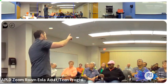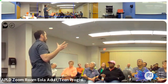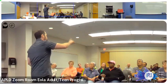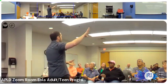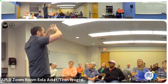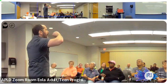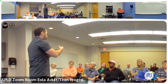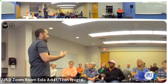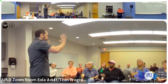One, they make washable pet filters. Like washable filters that are designed for people with like 5 and 6 dogs, right? So that you don't have to change your filter every week and take this thing out and wash it, put it back. And they sell them in all big box stores for your furnace. When you go look at it, it'll be sort of this black thing and it'll have dogs right on the front of it because it's meant for people who are crazy about dogs. You're probably going to have to cut all the plastic off and just cut this thing to size. Maybe just glue some cardboard around the edge. Because once it's in, it's fine.